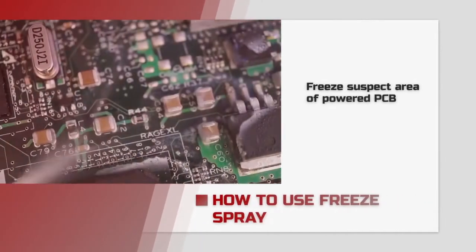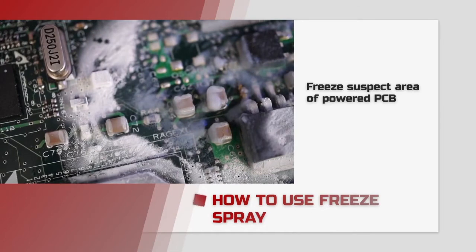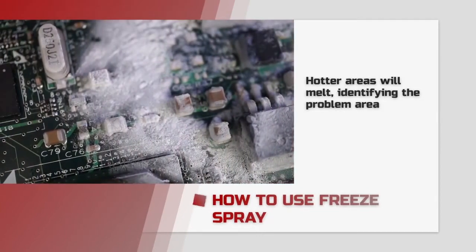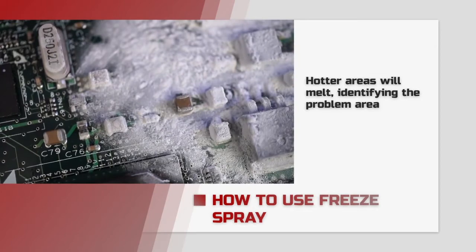to board failure. To diagnose a problem, saturate the suspect area of the energized circuit board with freeze spray. Any area that is hotter than the rest, like a faulty component or a cold solder joint that creates resistance, will melt the frost first, isolating the problem.